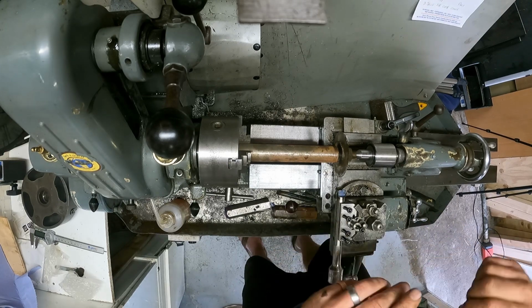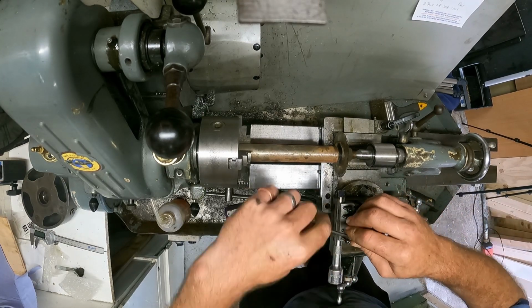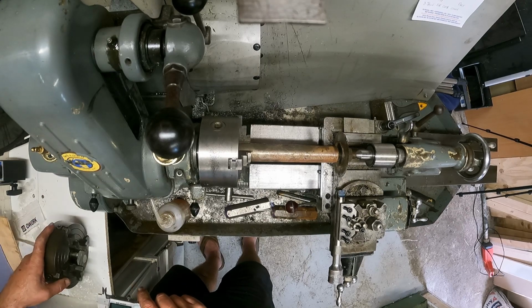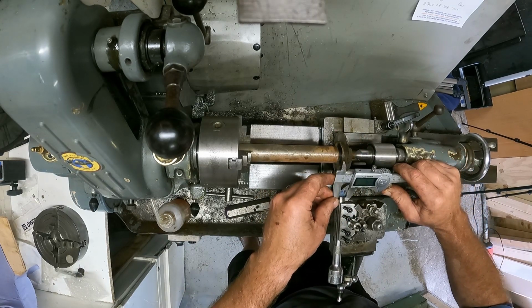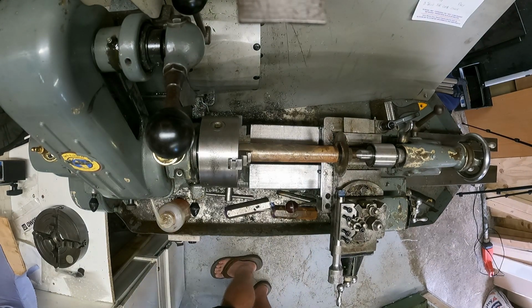Alright, let's see. Now I actually want to cut it as close to the position where I actually want to have it, because I probably hardened it with all of my silly maneuvers. Okay, so that is my thickness of the hole I want. If I zero that, undo the bar, then I got 5.8. So 5.8 divided by 2. Some of you clever people can work it out quicker than me. 5.8 divided by 2 is 2.9.